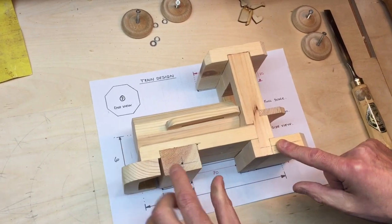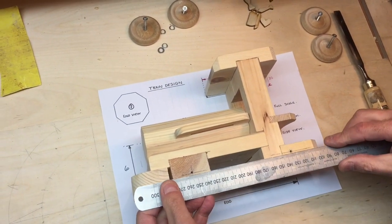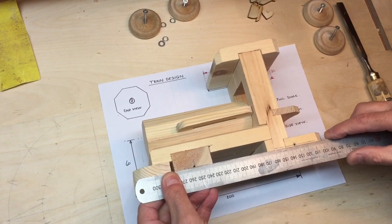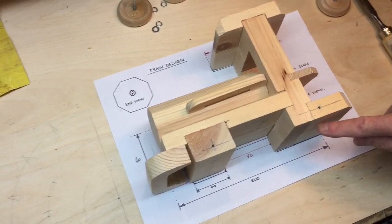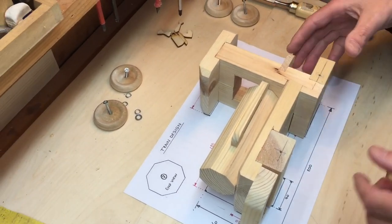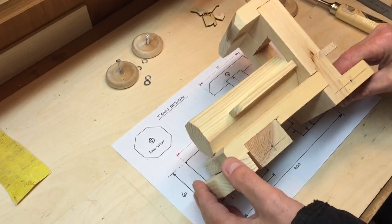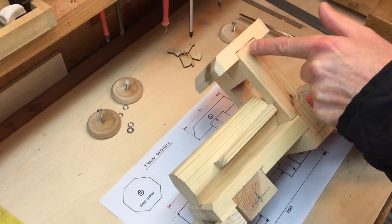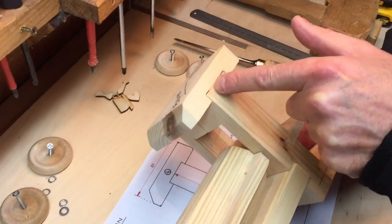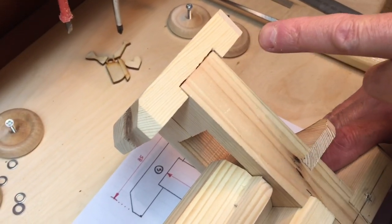The line for each wheel should be exactly the same, and you can mark it there in line, then mark them the same going through to the other side. It's a bit of common sense really on this one. I wanted to remind you about how it's put together — the top there is another rebate. You can mark out two lines and cut it out with the chiseling technique I showed you before.